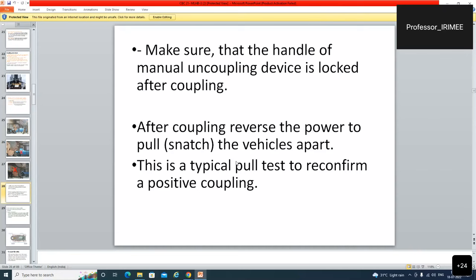If there was some gap in the knuckles, then we used to fill it with L-type sleeves. These L-type sleeves were made in 5, 10, 15, 20 millimeter intervals and kept in the train, and this gap was filled. And when there was a change of loco, then at that particular station, the train examining staff or our escorting staff were advised to collect the L-type sleeves. So these were the proper local adjustments,